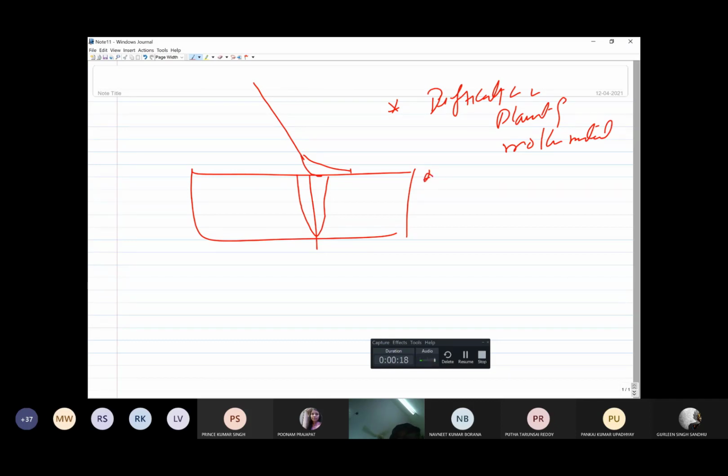Okay, that's one. And heat is being applied elsewhere, either on the forward or backward side. So your penetration, the depth up to which you are able to melt, is reduced or becomes inconsistent. You are not able to realize the depth up to which the melting should occur, and that is why somewhere there is deeper penetration, somewhere lesser penetration, so inconsistent welding.